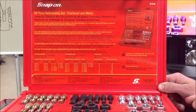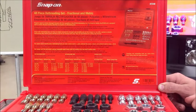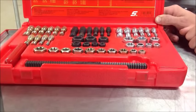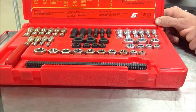We're at Western Army Tech today and we're going to do a quick video on thread repair. We have a piece of all-thread here that's got damaged thread on it. We're going to use our Snap-on kit here, part number RTD48. This kit is a restoration kit — it's not for creating threads, it's for repairing them. The big thing we're going to focus on here is thread files.